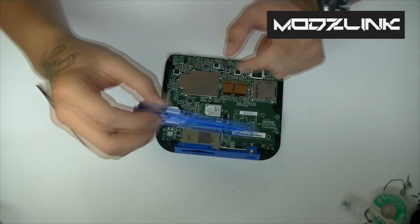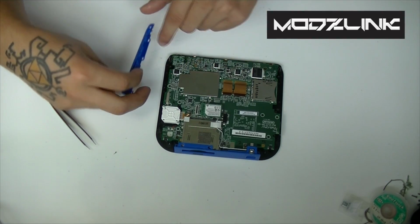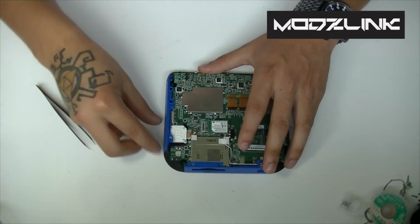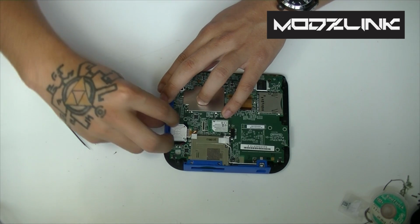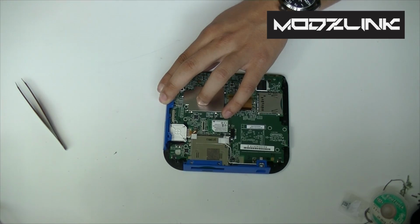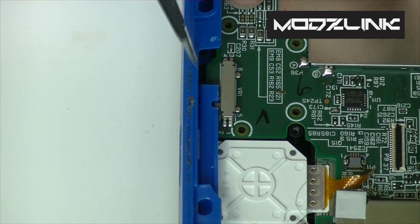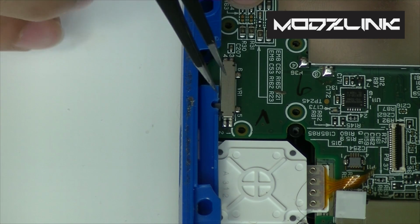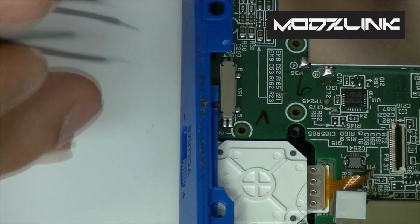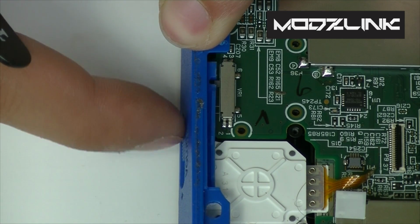If the volume button falls off, remember to realign it with the button here on the side. That way, when you slide the button down, it actually slides down this little lever here on the side. If you don't get this right, then let me zoom in here just to make sure I can explain this properly. This button, this is the button here, and there's this slider. So you need to make sure the button's little notch is set with the bar on that slider. That way, see, when you slide the button down, it slides down with that slider. If you don't get that right, then your volume's not gonna work.